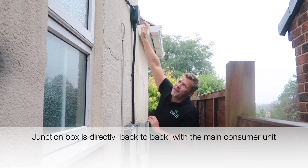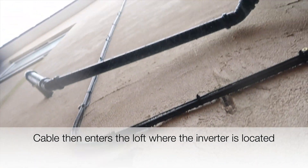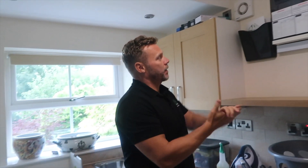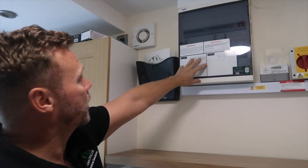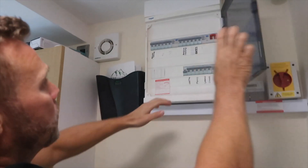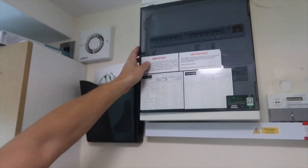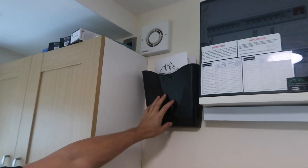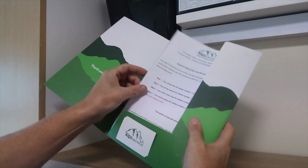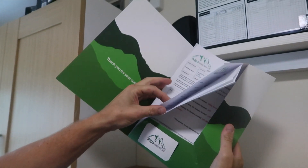This was an existing junction box because it feeds the annex outside, so we popped into the back of that, which was ideal — it gave us the opportunity to gland our armoured cable in here and run it all the way up to the junction box at the top. We came in from the back on the other side with our steel wire armoured into the junction box and straight into the board. We had to change one module for a Type A RCD, with our solar on a 16 amp breaker. We've also got the generation meter, first AC isolator, and we always like to leave our solar handover pack, which contains the isolation procedure, schematic, PV array test reports, and other commissioning checklists.